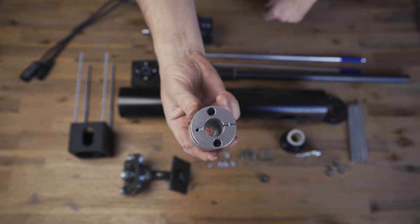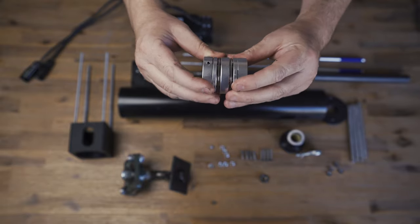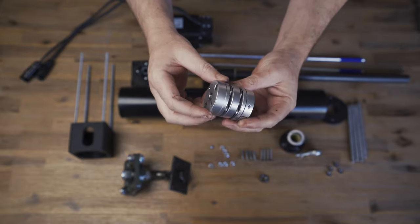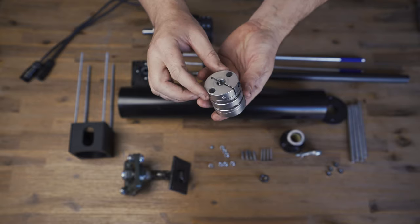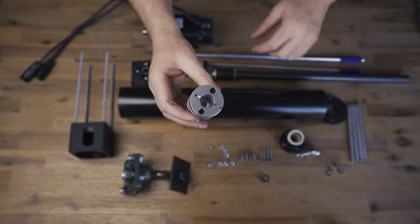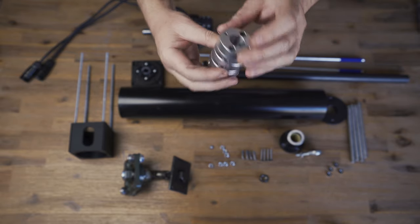The coupler is just an aluminium plate coupler — very high quality, actually. I got this from AliExpress. To suit the new actuators I had to just machine out one end by 2mm to fit the new shaft, and it's good to go.